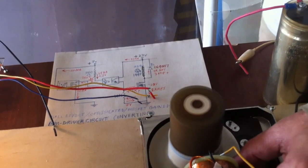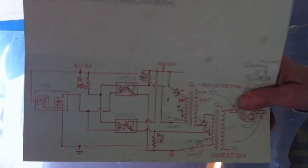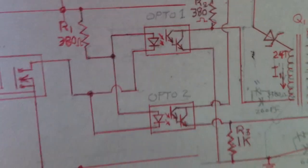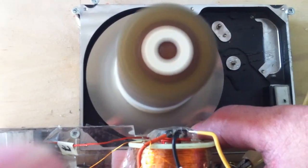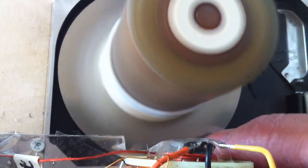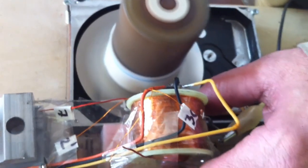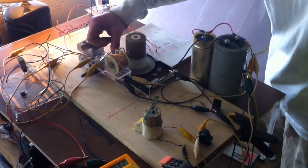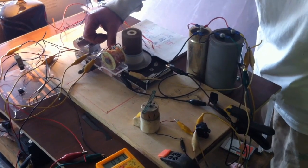You can get a little fancier with this circuit. The Hall effect will run two optocouplers — one of them comes out inverted and one comes out uninverted. But I'm finding that just putting it straight in the nose of the guidance system works well: when it feels a magnetic pulse coming it turns on, and when the opposite pole — the north pole — comes, it turns off. It sends out the digital message up to 10,000 or 12,000 RPM, using only a few microamps — very little energy. This gives you control over the speed of your generator.